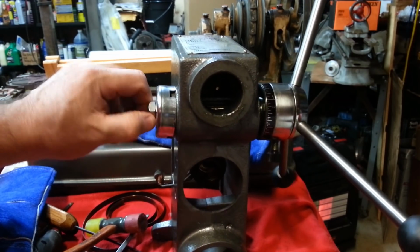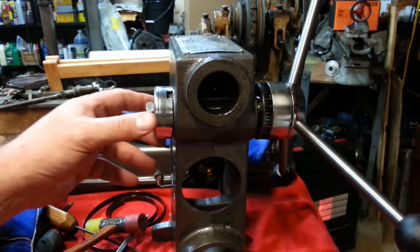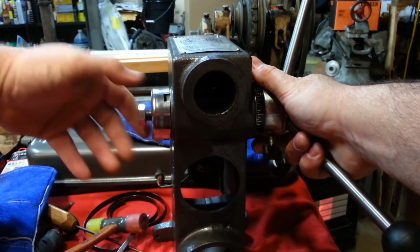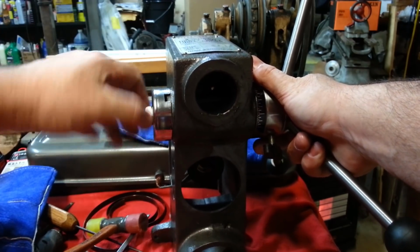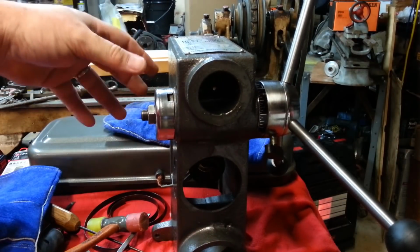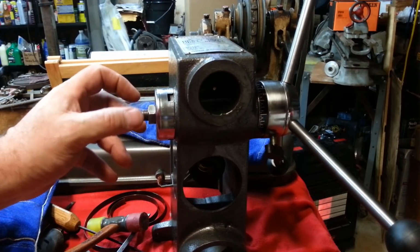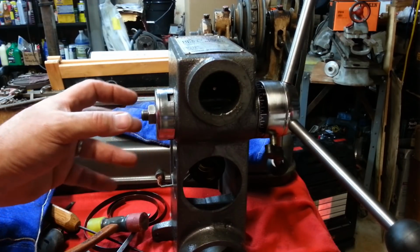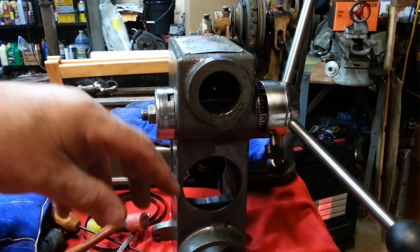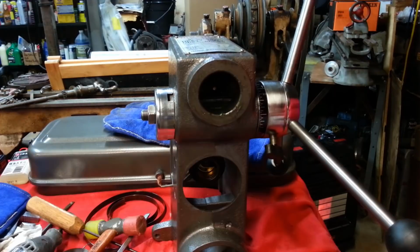Wow. I bought these thin nuts. This had one big locking nylock nut on it, which, normally there's two thin jam nuts here. But I find when you're using a drill press for hand tapping, when you reach up into the top pulley and turn it, that it's nice to be able to turn this and release the spring, or adjust the spring so that the quill is just kind of floating and not trying to retract. So I might actually replace this with a wing nut.